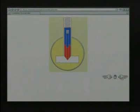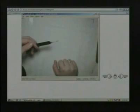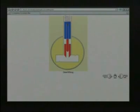and that's how the shear line is met. Well, just because a key only lifts it so high doesn't mean you couldn't stick something in the lock that would lift that inner pin higher than it's supposed to be lifted. What happens then? We get what we call the overlift. The overlift achieved, we've been mocking up some tools with these little comb type tools. The overlift is the fundamental for the Michaud attack.